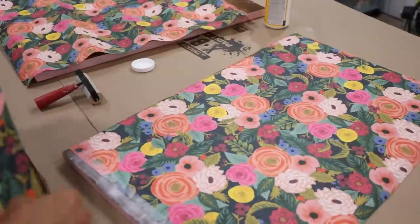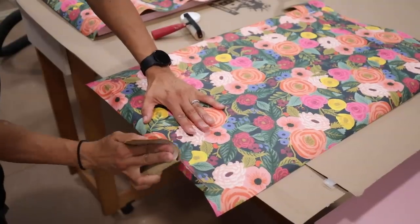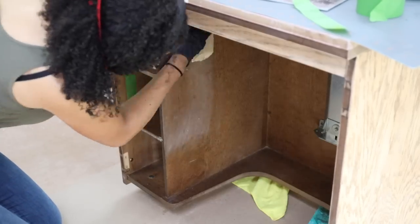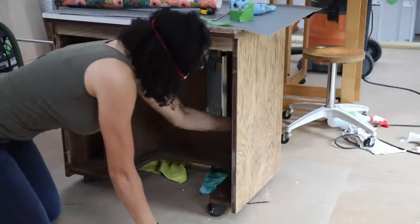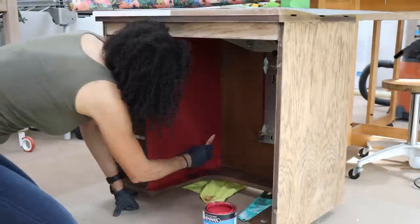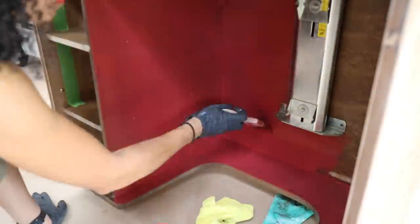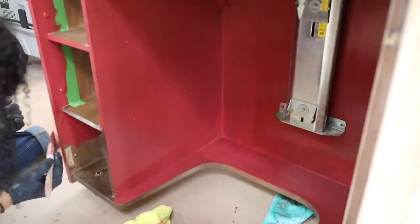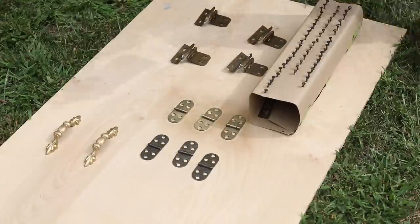I did use sandpaper on the interior of this sewing cabinet as well. Typically, if I'm using furniture paint I don't sand, but this is a color stain — it's a little different — so I wanted to make sure it was going to adhere. After two coats, I let it dry. It takes about only one hour to dry. I used two coats of the polycrylic to give it a nice hard finish. I did paint the interior of the bottom because there was no drawer there, but for the other two, I just put some painter's tape — I didn't paint the entire thing.